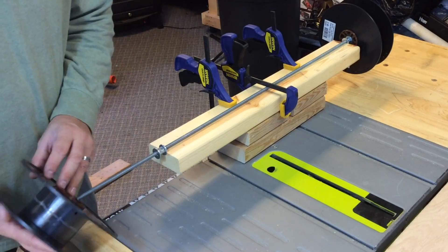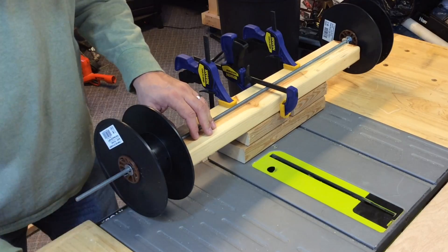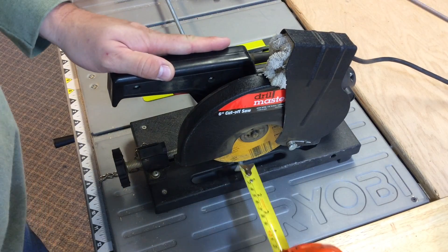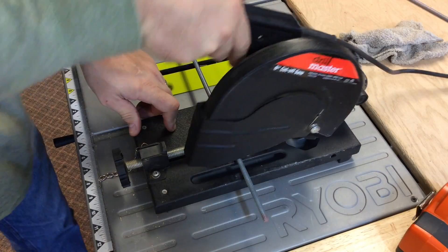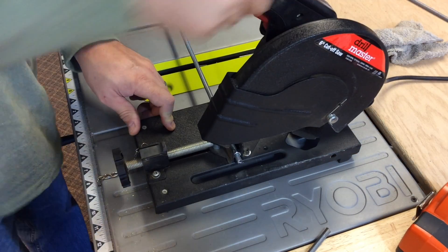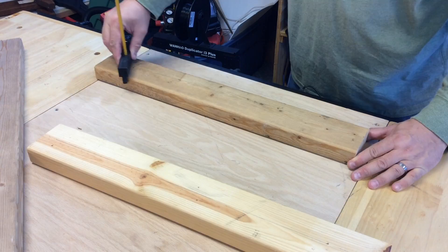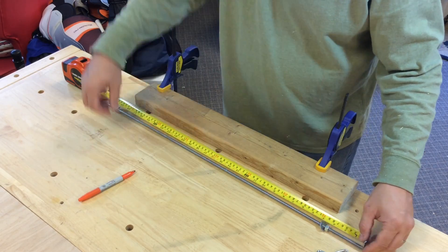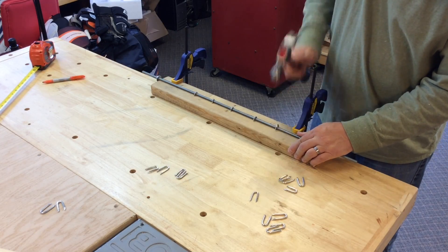I needed to cut the threaded rod to the proper size. By now I had four hubs, or two wheels, so I put it all together, measured it, and I was four inches too long. I put two nuts on the threaded rod to clamp down and allow me to turn it, then cut it and backed the nut off to fix the threads. I used my 3D printed centering tool from episode 54 of Filament Friday to mark a center line on the axles, then marked the center of the axle, positioned it at the center of the board, and used U-nails to hold it in place.